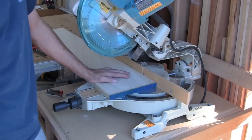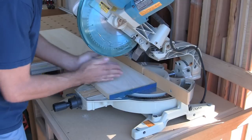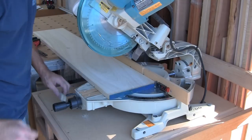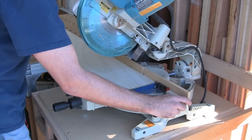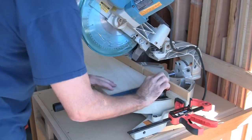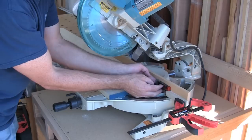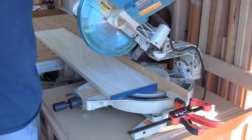I'm not going to cut it with the miter saw, but just to show you — it's all a matter of setting yourself up a different type of stop block. If I wanted to cut part of the shoulder here, I would simply place the KM1 off here on the side, set up a little stop block so I can reach in there and grab it, clamp that into place, remove the KM1, go ahead and make my cut, put it on the short side, slide over the stock, make my second cut, and I'm done.